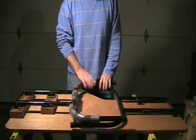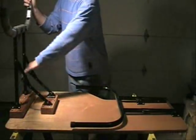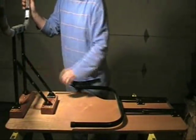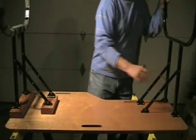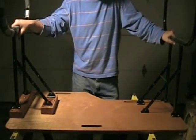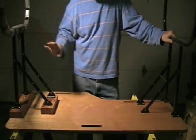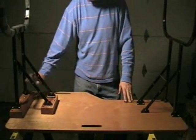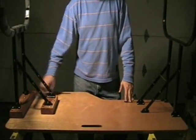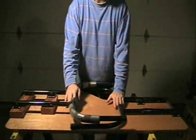You can also make this table using just regular standard banquet table legs that are available at Home Depot or maybe even office supply stores. They make a table that's a little bit shorter than the Rugged Buddy legs — it sits about 31 inches high as opposed to 34 inches from the Rugged Buddy legs. When you install these legs, just note that in order to fold them flat, you need to block up one side of them using 2x4s. That way the legs will sit flat.